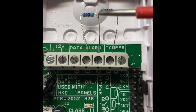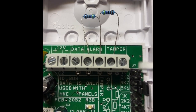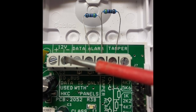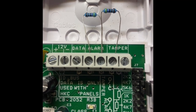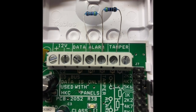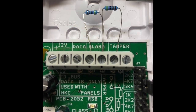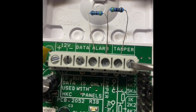You could put resistors in to make them comply with the new type alarm panels. On the new alarm panels you would still have positive and negative supplying power to the detectors. You would bring one wire all the way back from the alarm panel — all the way around and in through the back of the detector, usually through one of these holes here. So your four-core or six-core comes in.